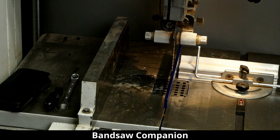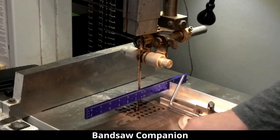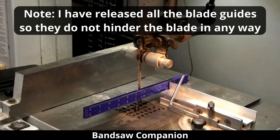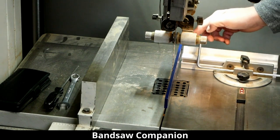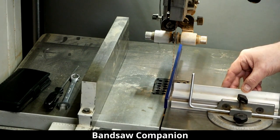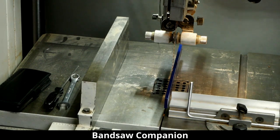We've got it set up, magnetized to the blade — it's just balancing there, and the set of the teeth are not interfering with the straightness of the bar. Now we can judge the gap of our miter gauge all the way down the blade to see how well it's running parallel. It looks fairly even, so the blade is tracking well to the miter slot right now.